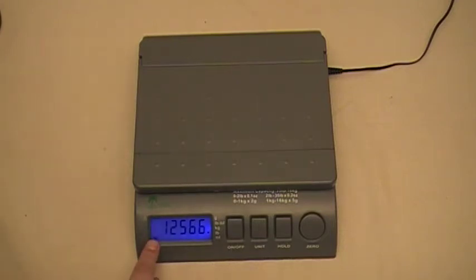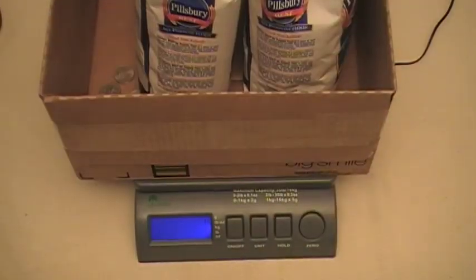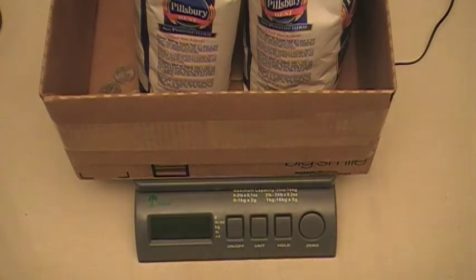Once the stabilization indicator comes up, press the zero key and it's going to start flashing — now it's ready for our test weight. So I'm going to put that on there and wait a few seconds for it to show that it passed. Passed — now we know that it's ready to go. To save it, just press the on/off button and the setting is saved.